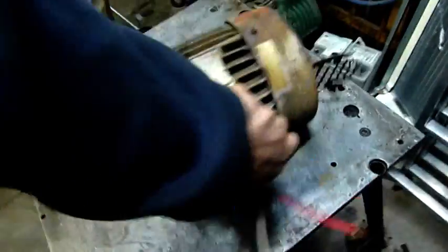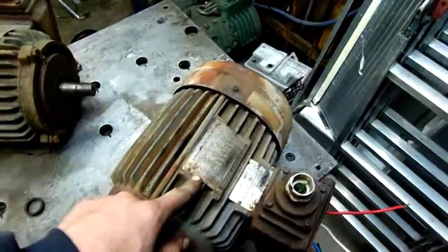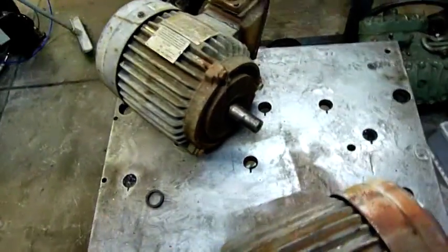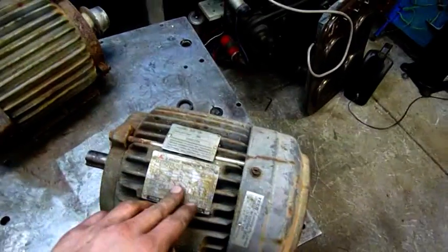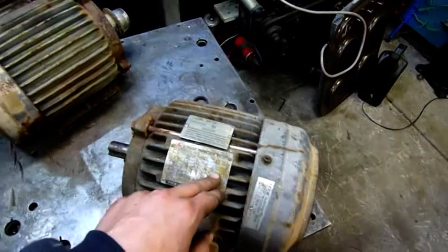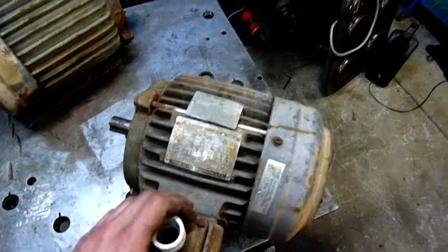This one is nice and clean, hasn't had moisture in it, so I want to fix this one up. I don't have a good 2 horsepower 220 or 240 volt 3-phase motor as it is. The only other ones I have are dedicated 415 volt — you can't change the actual winding from star to delta or vice versa. This one's the same: 240 volt 3-phase or 415 volt 3-phase, only 2 amps at 415 volts. They're not a bad motor.